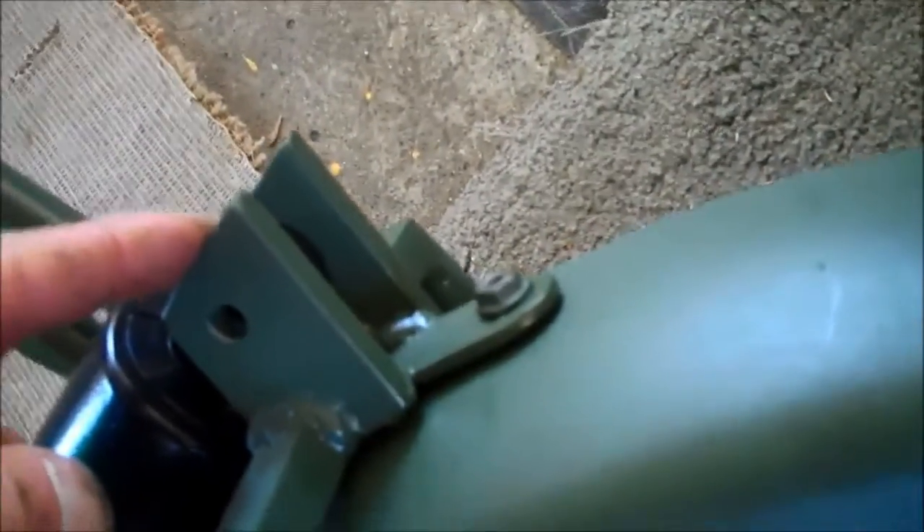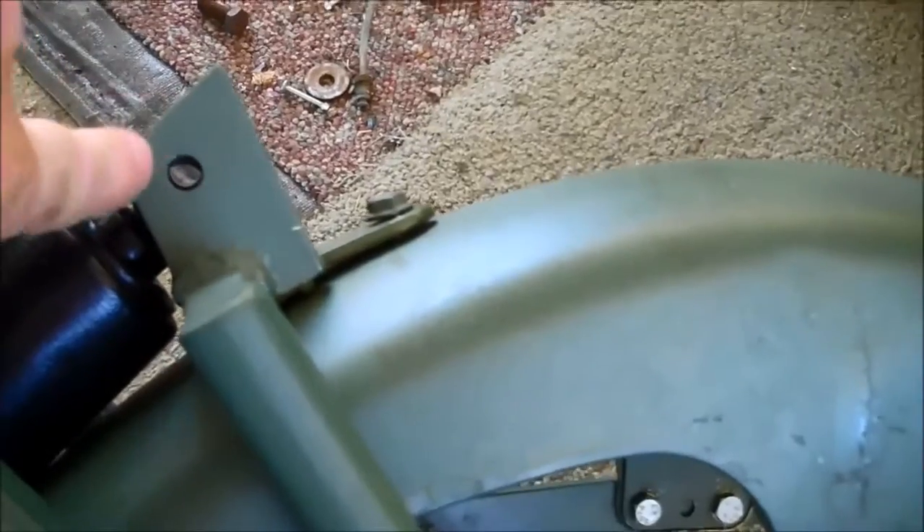This is like a quarter inch by inch and a half. These are made to suit you, but they need to be fairly heavy duty to hold the top of that shock in. The bottom mounts — on this particular one we wound up with sixteen inches between the two of them — it's half inch by one inch, half inch thick by one inch wide strap material.